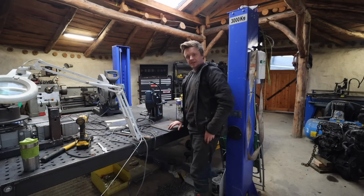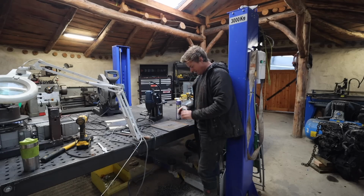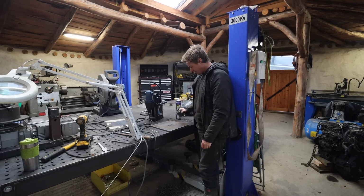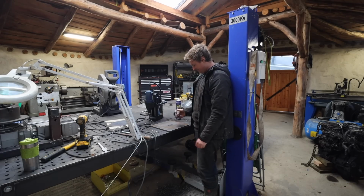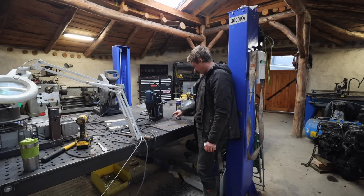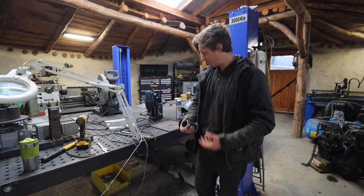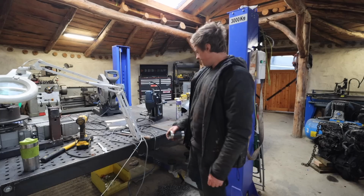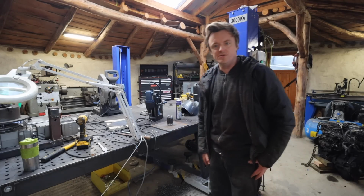So I'm just carrying on with these plates. I'm just welding the tube on for now, doing it in stages. So I drill all the holes from the mounting to a concrete base and weld that tube on. Then we put another plate on top and then the blade on top of that. I'm manually drilling these holes because the plasma cutter doesn't cut great holes at such small sizes. You always end up having to clean them up anyway, so I just drill them out because I've got the mag drill. Yeah, just carry on with them, got a lot to do, 19 in total.